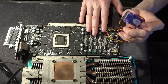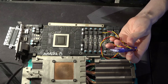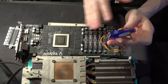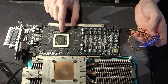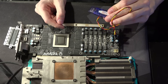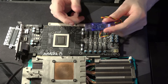The thing is, with the 290X, this is super laggy. I think that might be because 290Xs apparently just have a ton of I2C/SMBUS traffic on the communication to the IR3567B. Flashing a BIOS on one of these absolutely sucks — it takes forever. I think that's why this was super laggy, but it might just be laggy all the time — I'm not sure.